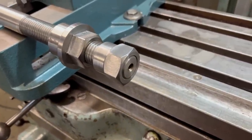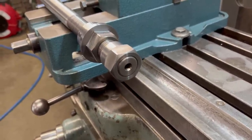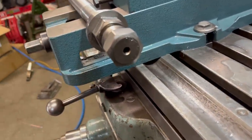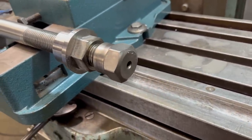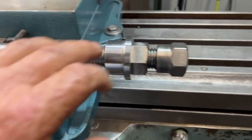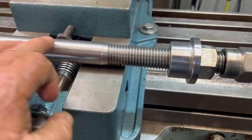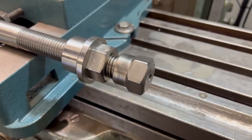Filming on the phone for this last little bit. The hexes are all on - they turned out pretty nice. I think I'll run around the top of that with a TIG, just fuse it on, and then I can easily turn it off if I need to get it apart. That's all welded together - a couple of little inclusions on top but it's on there, it's not going to come off. I welded around, put a bit of filler rod around it, then turned it back in the lathe, squared it up and cleaned it up. The drawbar is finished - except for this bloody mark I put on it. The nut was up against the end nut in the vice and in the chuck it put a mark on it - not really impressed about that, anyway, drawbar is finished.